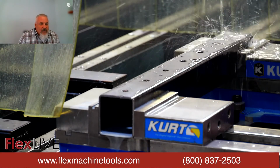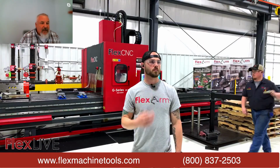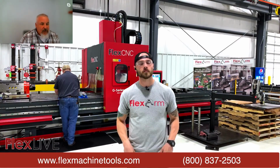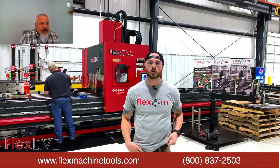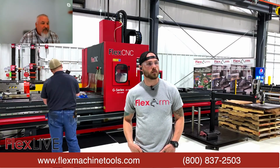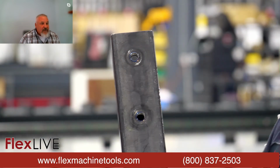We do have a proprietary lubricant. We have a paste form for manual operations where limited number of holes where the operator has the time to apply it to the bit itself. In this case, where we're doing machining centers, we likely opt for a spray system, and that's a liquid lubricant. It's the same consistency, just in a liquid compared to the paste. What it's designed to do is just create a barrier. We're not trying to cool the flow drill. It's a thermal drill operation, so we rely on that heat. But it does coat the bit. It prevents it from picking up particles of that parent metal, sticking to it, just to prevent that buildup material from sticking on there.